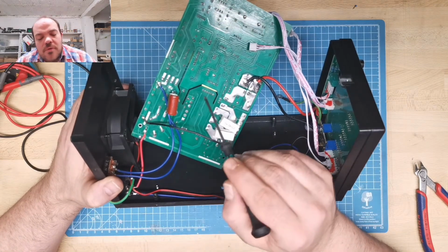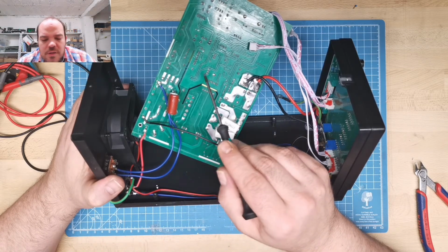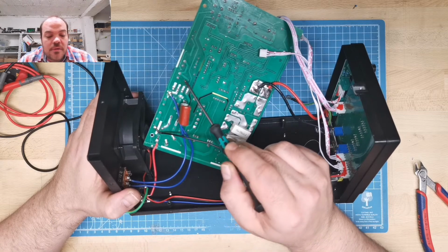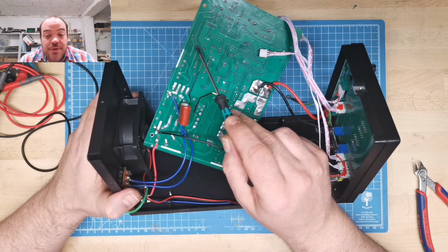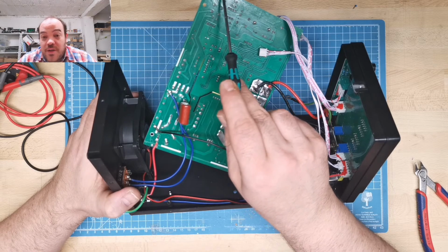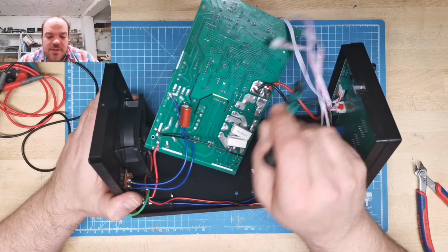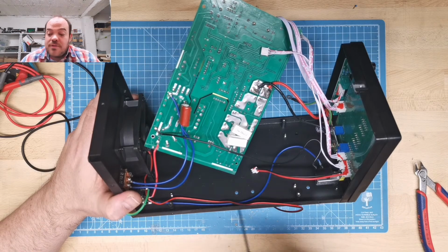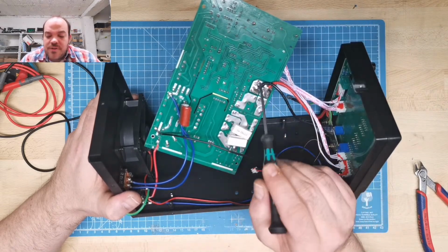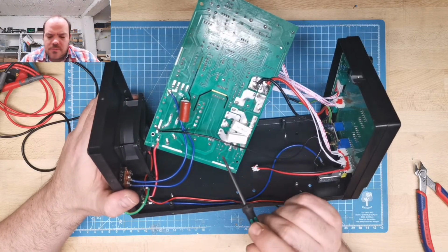It has some separation around the main transformer, but still this whole side here, this whole area is the 230 or the 240 volt area going totally to the front. A big separation between the lines here, so no worry about this. To the secondary auxiliary power supply for the display, and then this may be all the regulation stuff. Okay, the separation looks good, to be honest.